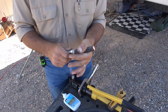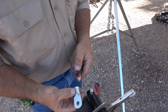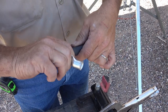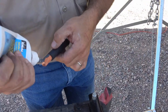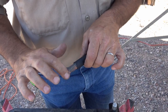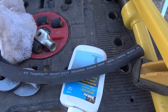These thick cables can be hard if you've never done them before - there are a lot of fine wires in there. You have to make sure that anything that's been cut, as you're doing the sheath, is all clean. And when you put the No-Lox on there, you've got to make sure all those wires stay put because you won't get them inside the connector otherwise.